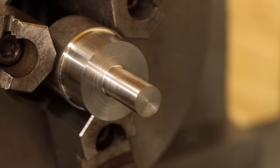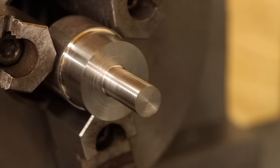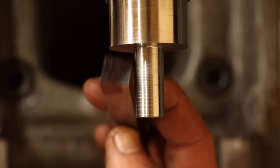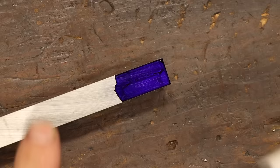This stem continues another quarter inch into the top of the cap and forms a square profile cavity. But I can't just mount up any old tool to do this. Come to think of it, this is a new operation for me altogether. It's time to try my hand at trepanning. If you're not familiar, trepanning is a grooving operation but in an axial direction as opposed to the more common radial direction. And because of this axial movement, a special tool is needed that will give me appropriate material clearances. A special tool that I don't have. You know what that means.